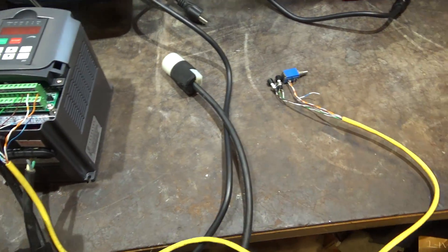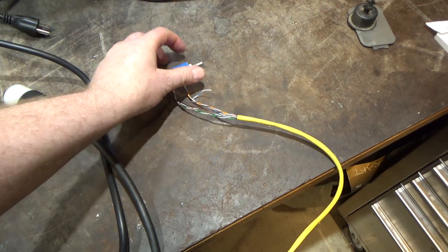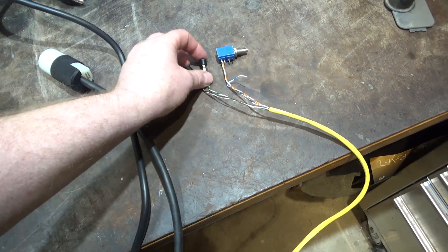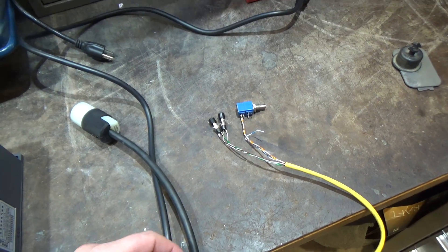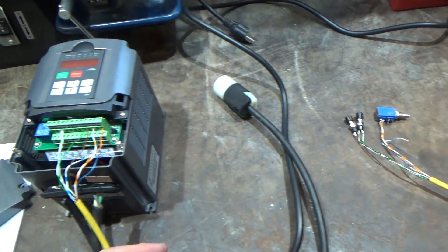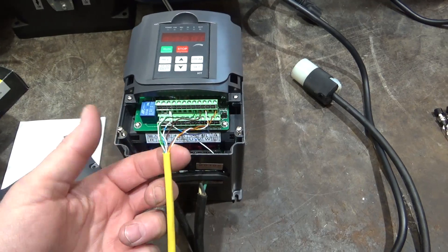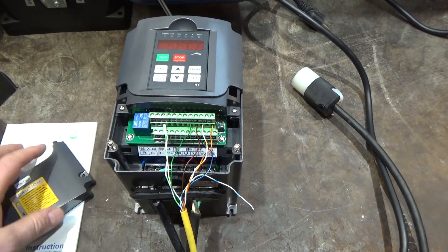You can remote some of the controls. I was playing around with speed control using a potentiometer, plus start and stop — but it turns out those inputs want latching switches and what I had were momentary push-buttons. So that was just an experiment, which is why it looks a bit kludged in. It works just fine though.